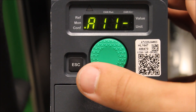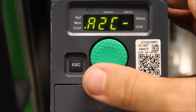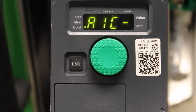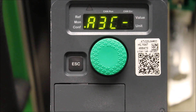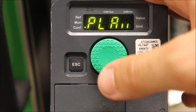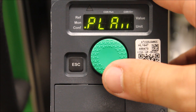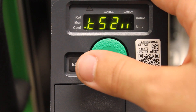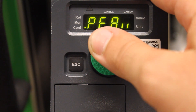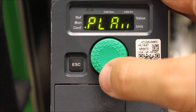There are actually three things we can take a look at here. The first one is AI1C, the second is AI2C and AI3C. These are your alarm parameters. You can press on each one and see what they're programmed as. If they're programmed to a specific function where your drive is looking for 4 to 20mA loss, you can just go and make that a no assignment if you'd like.